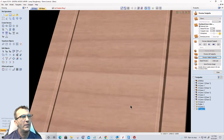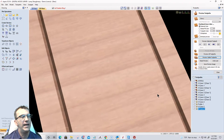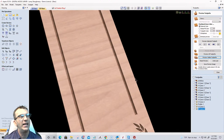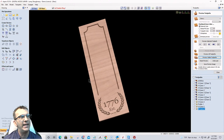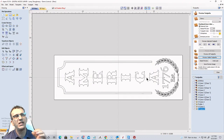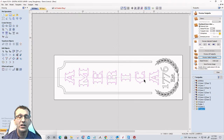And yeah, I don't want to go too much deeper than that. I'm already at about 3/16 of an inch deep, 0.1805, and that's going to be good. I don't want to go any deeper than that with that. Now, the text is the biggest of all. I could use my 90 degree V bit, but it's still going to be too deep. So I'm actually going to use a 120 degree V bit on this.